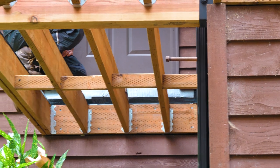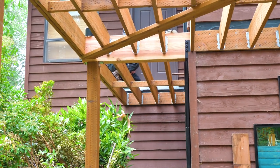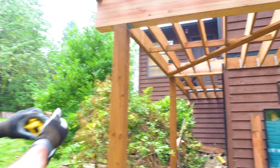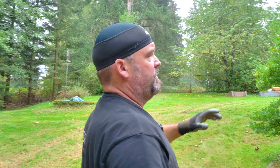What you can do is put a temporary brace in where that board is bowing out a little bit. Because this other joist has just got an ever-so-slight bow, you can put a clamp in there, open it up, put your temporary brace in, and then take the clamp off. That can just stay that way until we get all our deck boards screwed in, and then you'll be all set — cash money.